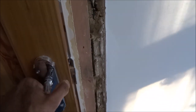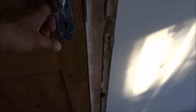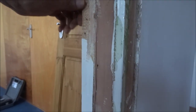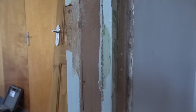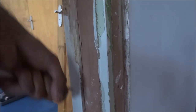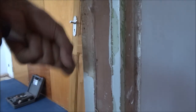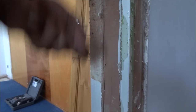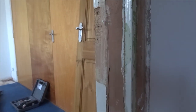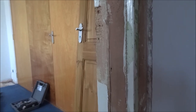It's quite good that I don't have to take the frame out now. It was actually just clipping in about that much. I've taken the door off now and I've taken the hinges and everything off. So what I'm going to do now is just start scraping off the paint. I've got a slightly older chisel — it comes off pretty quick, probably better than using a blow torch. Bit of effort to do, but it comes off pretty quick.